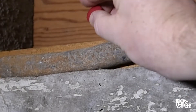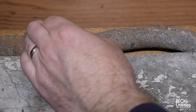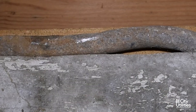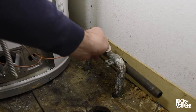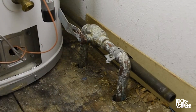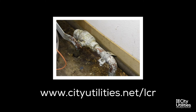If the magnet doesn't stick, move on to the second test. Grab a coin and carefully scratch the pipe in the same location where you stuck the magnet. Lead will scratch easily, revealing a shiny silver color beneath. If your pipe reveals a copper or golden color when scratched, it is likely made of copper or brass. Be sure the pipe is not painted when identifying the pipe type. Take a photo of the scratched portion of the pipe and submit via the electronic form found at www.cityutilities.net.